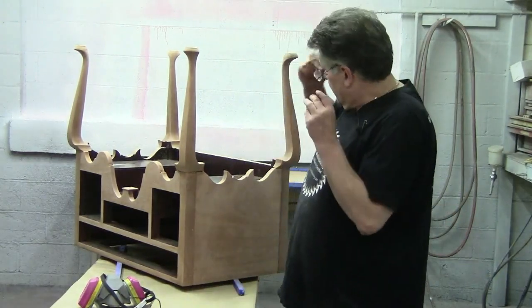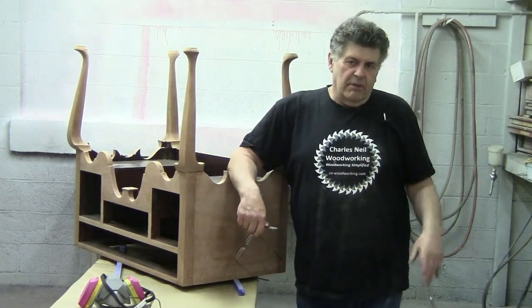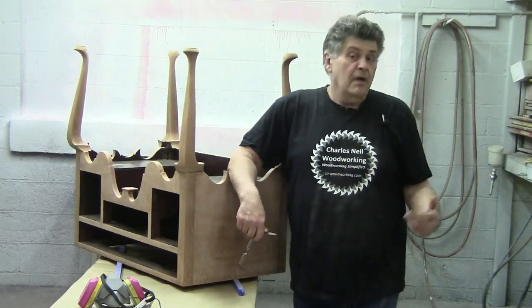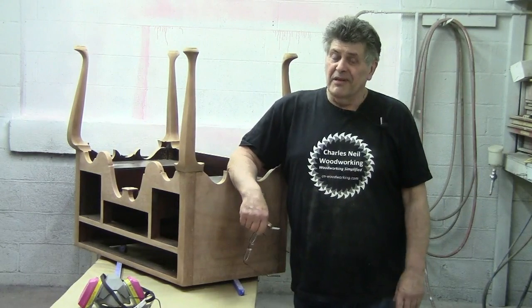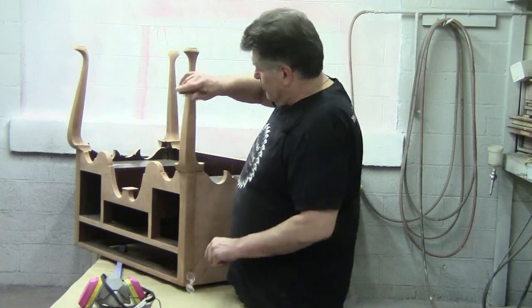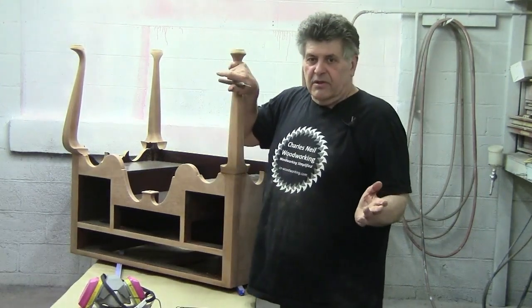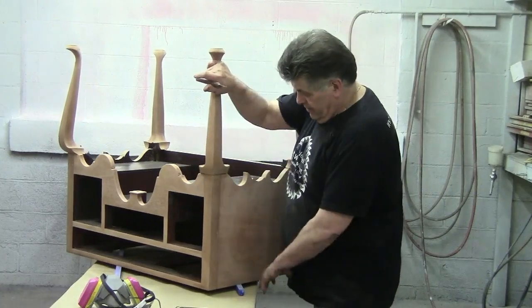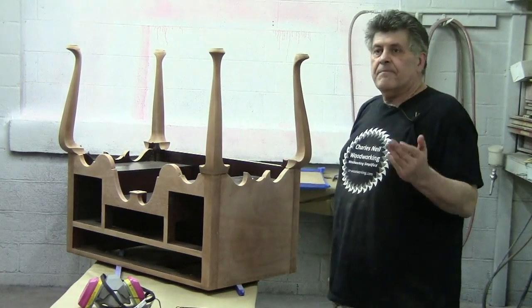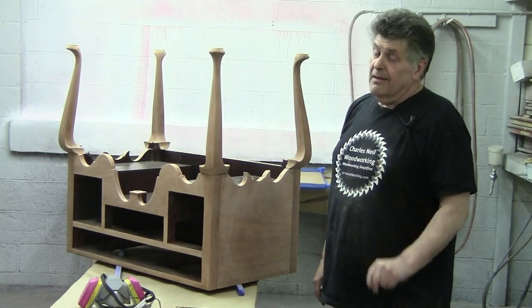Now if you were using something like a real thin oil finish, you'd probably be okay. But throughout different things we're doing, you're going to see us cutting those joints a little bit to allow that wood to move. And right here on the front apron, where this is, what, 3 inches or so, that's not enough to concern yourself with. But here, it is. That's dealing with joints that move. Again, a breadboard, whatever. It makes a difference.